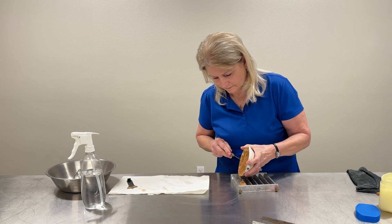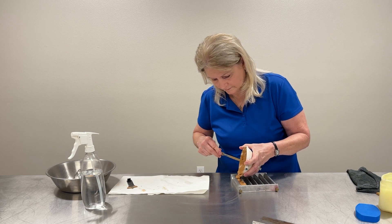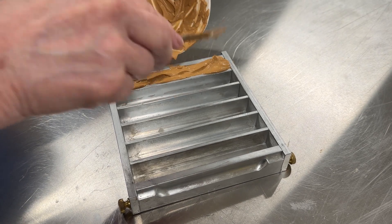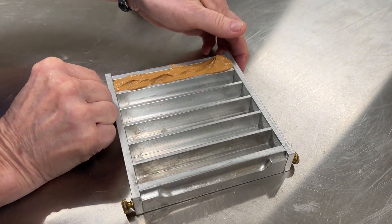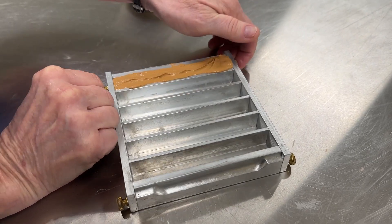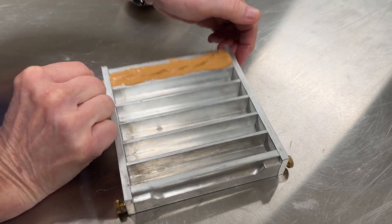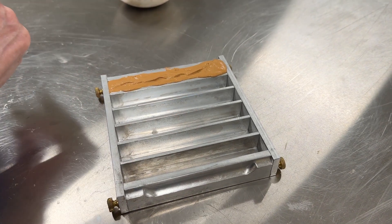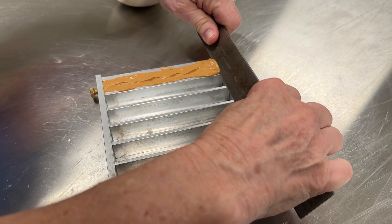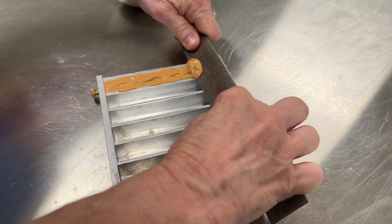Shape the soil bar by placing a small portion of the wet soil evenly into the mold and gently jarring the mold to cause the wet soil to flow and to assist in the removal of entrapped air bubbles. When the mold has been completely filled, remove excess soil from the bar by means of the straight edge and smooth the surface level with the top of the mold.